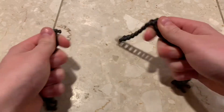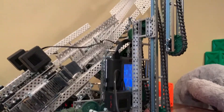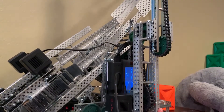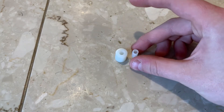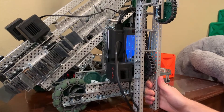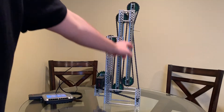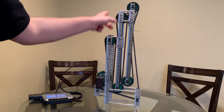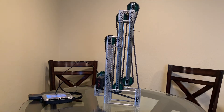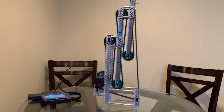Now there are a few things to note. One, you don't need to use sprockets — you can simply use spacers if the chain runs over, but I chose to use sprockets to better illustrate the motion that makes this lift work. Another thing to note is that you can get better performance due to lower friction by not using the VEX slides. This is normally accomplished by using C-channel and some modified spacers, but that's outside the scope of this video. Another option for powering the mechanism is to run a continuous loop of chain throughout the whole mechanism, as an option if you don't want to go with spooling around the sprocket. This can cause some problems depending on how your intake is mounted, but it's worth mentioning as another part of the lift design.